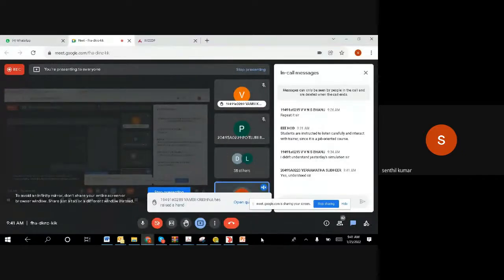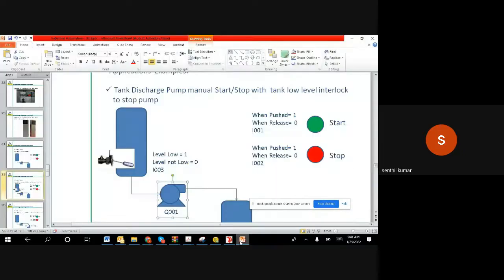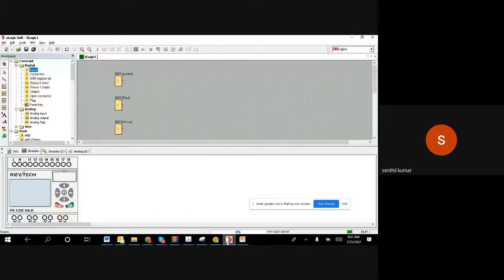Yeah, so it looks like it is clear now. So we will go ahead further. Right. So the digital inputs we have connected. We are very clear: we have taken a software component from digital and attached it to the pins I1, I2, I3, where we have physically connected the switches. Right. Now the remaining part is the output.